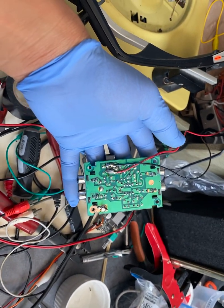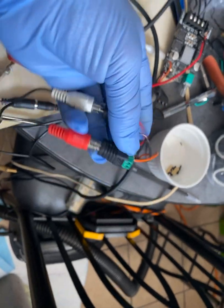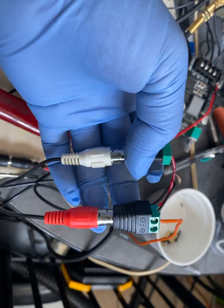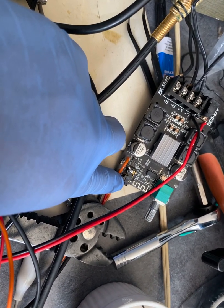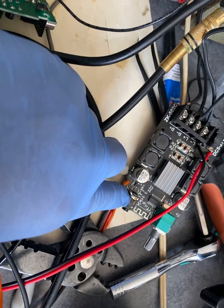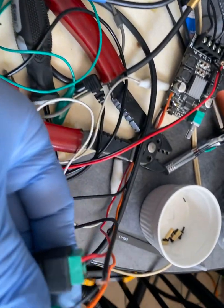And I'm going to run the out from there into the RCAs I soldered into the quarter-inch headphone jack, which are like this. But I didn't have any room. By the time I mounted this, I wouldn't have any room, so I had to turn it into RCA. So this is turning into RCA. FYI, from the very tip, or from the out going in, the very tip, this is negative. Next one in is positive right channel, and then one more in is positive left channel.